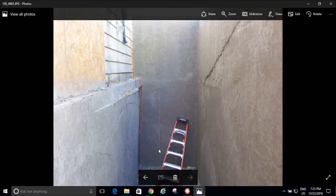And then you see stuff like this right here. What happened is I put wood inside my forms because I had to keep the rebar away from the side of the forms, and that's how I did it, with the wood. Well, when the stupid forms blew out, they put so much pressure on it that I couldn't get the spacers out. Luckily, when we started filling these higher walls, it spread the forms apart, and I was able to pull the wood out. But by that time, you can see this concrete right here by the side of it had already started hardening.